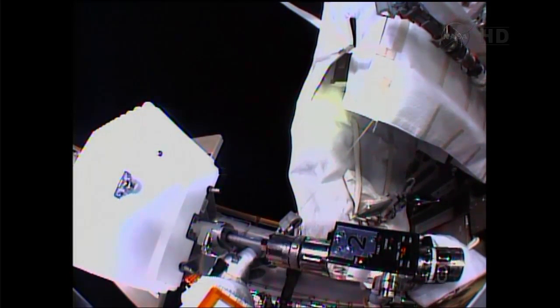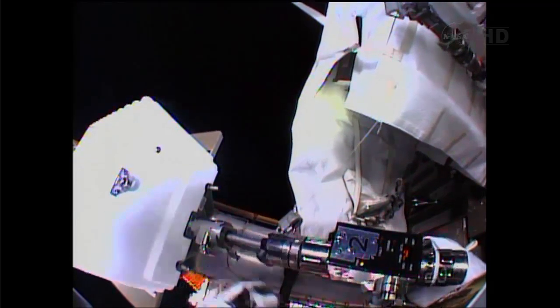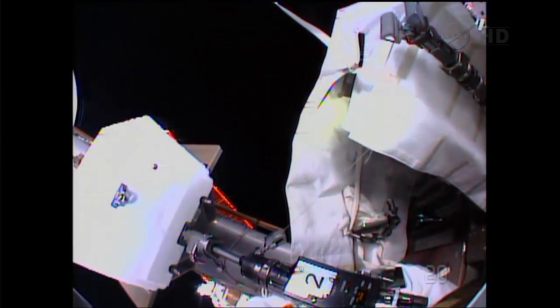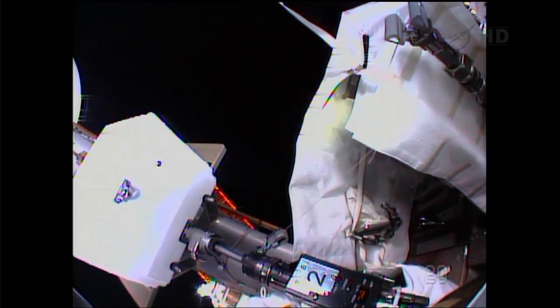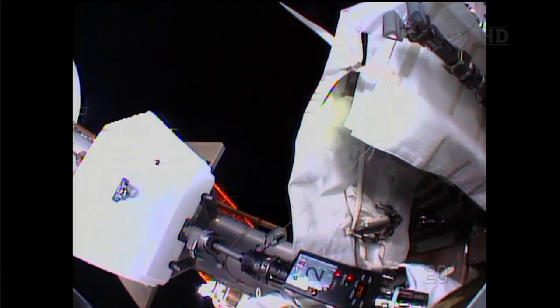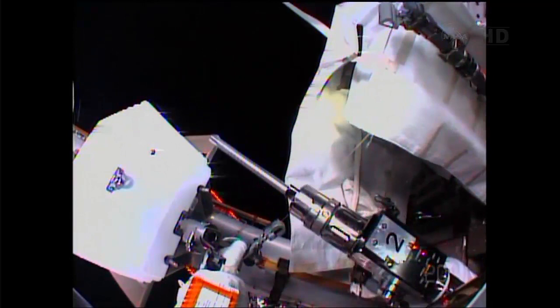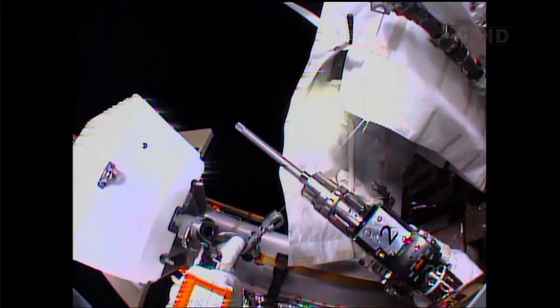Copy. 16 turns. 18 for 26. 19, running torque picking up. 4, 5, 6, 7 pounds on the running torque. 22, 23, 25, 26 turns. 7.4 was the max torque it saw. And of course we have a red torque light.